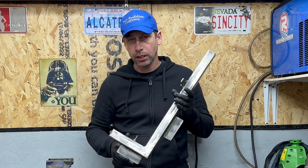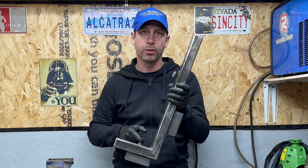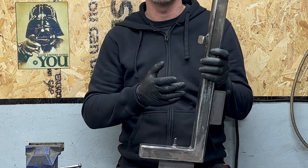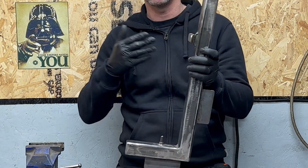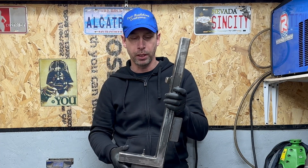The base is all welded together. The uprights are all in place. I've added an 8mm bolt to locate the fork, along with a support for the fork in the form of a piece of flat bar, slightly curved, with a gap behind it to allow us to put a velcro strap to help secure the fork to the base.